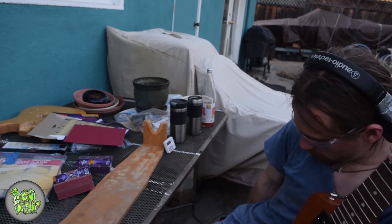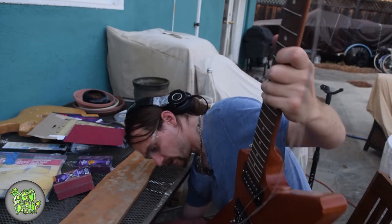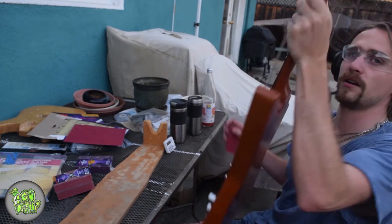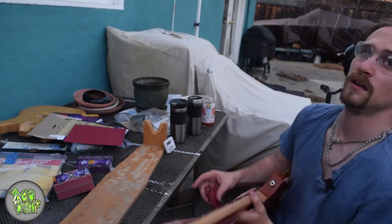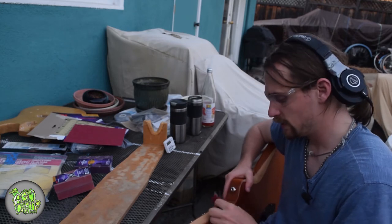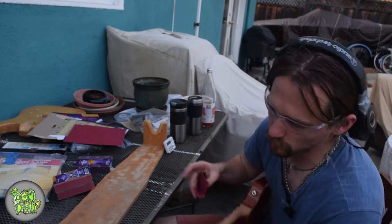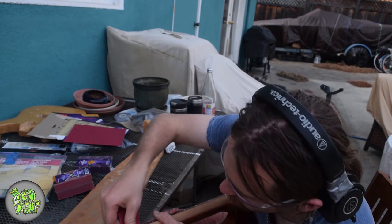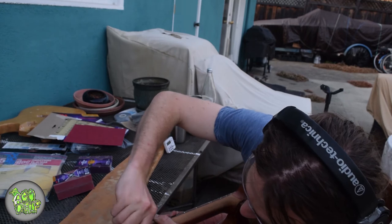But the value in that is gradually some amount of material will come off, especially while I'm under 150, going into the 300 grit range. Under 150, I still will be taking a lot of material off. So it's okay to kind of undershave with the file and let the rest of the work emerge from the sandpaper. It's kind of hard to know when to stop because it's really easy once you get going to just keep going. You want to just go until the end.